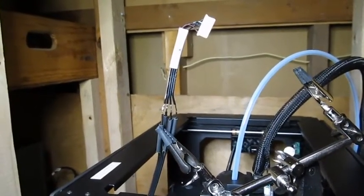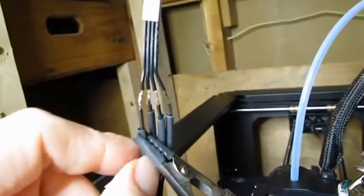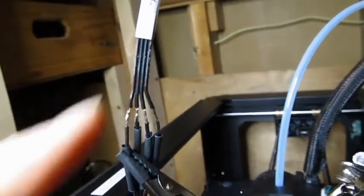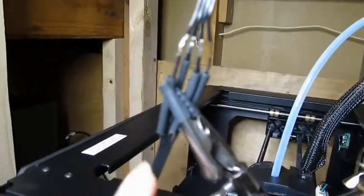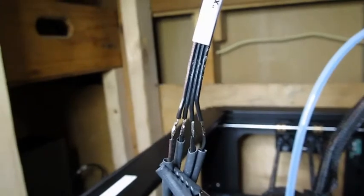I just want to quickly show you how the splice was done. This is the cable that runs into the MakerBot, and this is the part that goes to the motor. Here's the section that I cut out with the damaged cable, and here's how it spliced back together. I pulled each wire separately out and then soldered it back to the connector piece, making sure that the red on this side matches the red on that side — that's how you can tell you got it on the right way. I've got some shrink tubing here that I'm going to heat up to protect each wire from shorting against each other.